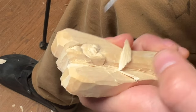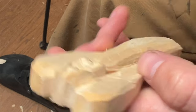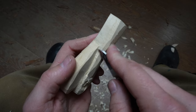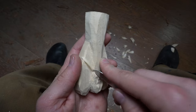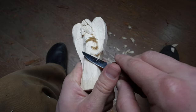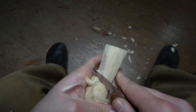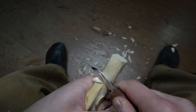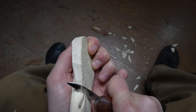Just cleaning up around the body, making sure there aren't any fuzzes. For finish I like to use a poly acrylic — it's by Minwax. The main reason I like it is it's just so easy: pop it outside or on cardboard, lightly spritz it, let it dry. You can coat it again. It protects from the environment and humidity changes, especially if kids are playing with it. And if you're thinking of painting it, you definitely need a wood finish to prevent colors from seeping into one another.